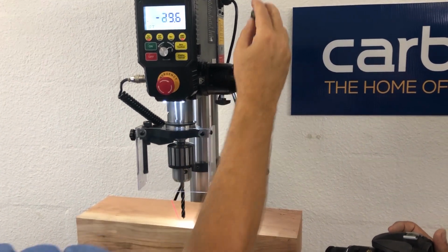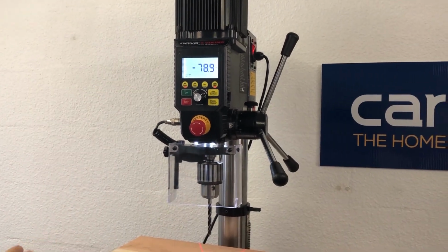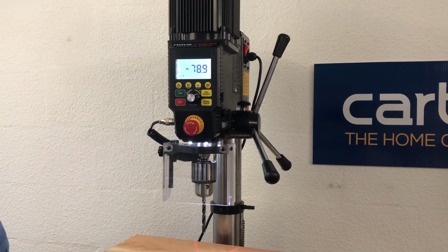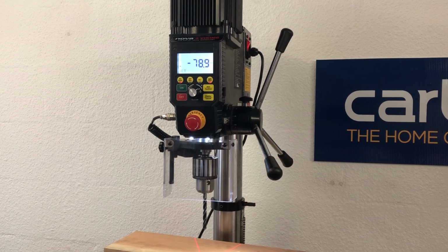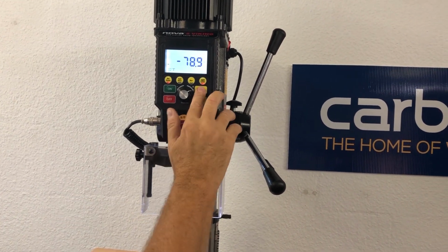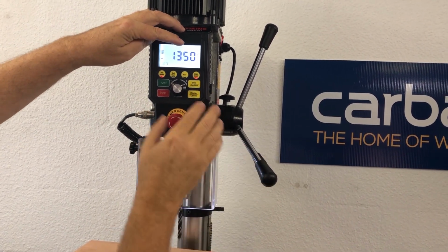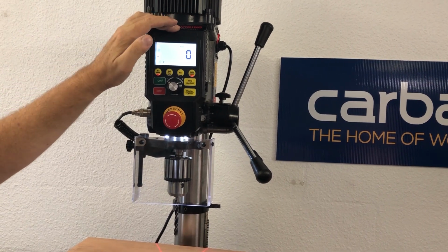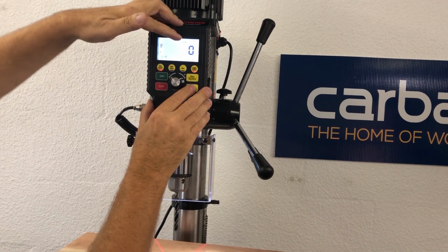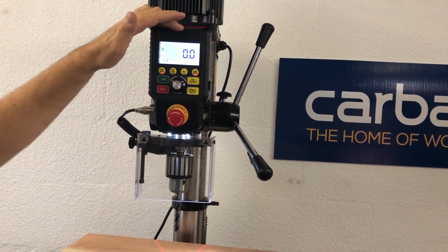All right. The option is also to have it reverse spin until it comes all the way to the top, similar to the self-start. Obviously that option would be very useful if you were unwinding a tap and had tapped a hole. So those are your controls up here. I guess I can toggle through the displays. So obviously depth is there. We can toggle through it. We have depth, we have RPM. We also have power, if you're interested to know, maybe it's a process where you want to see whether you're at 100%, but I can tell you this is a very torquey little drill press.